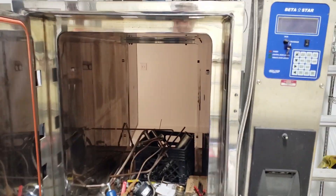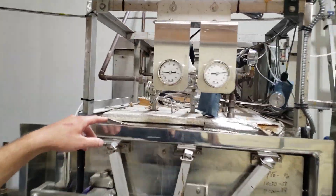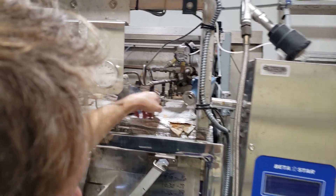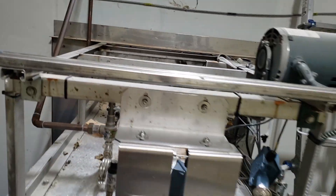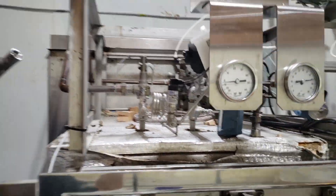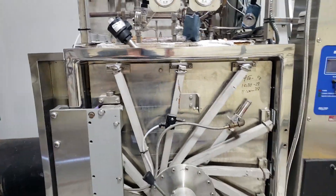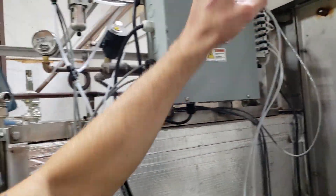You can see the other side inside the lab over there with another door. I went and removed the heat exchanger that used to be over there and we're now just gonna have a steam in-line. There's a port on the back that is gonna be the steam in, and then the jacket steam in is gonna be the end of this pipe here. There's a fitting wiggling right now — that trap filter is where the other steam in is gonna be. We're gonna keep using these pneumatic valves; that's the steam valve itself. When you send air to it, it opens the valve up, making it easy to automate with solenoid valves.